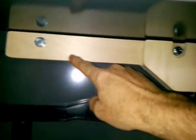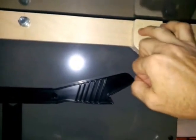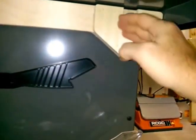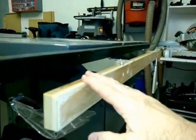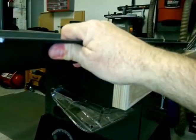What I did is I used that same type of wood — half-inch birch plywood. I made this little angled arm coming out, used existing bolt holes, bought a half-inch longer bolt, and replaced my original bolts with those bolts and bolted that on. I doubled it here because this would be the weak spot with the angle, and also to give me a little more thickness for securing my rail to it. I did the same thing on the other side. This gets the whole thing, if you look from this angle, down lower and away from my angle iron that I need for my rip fence system.